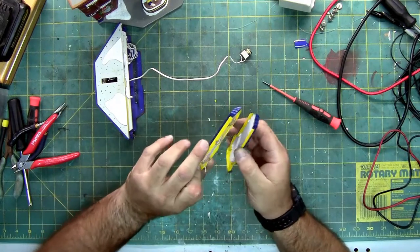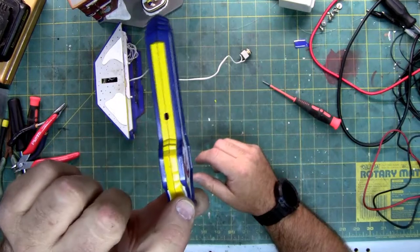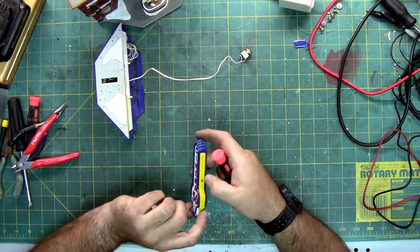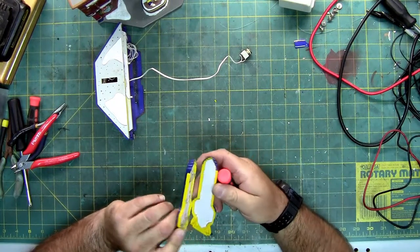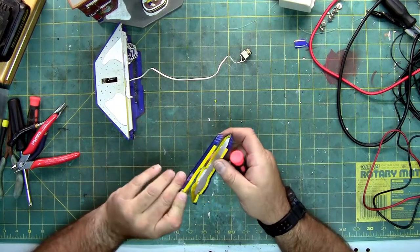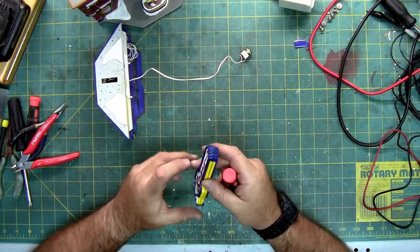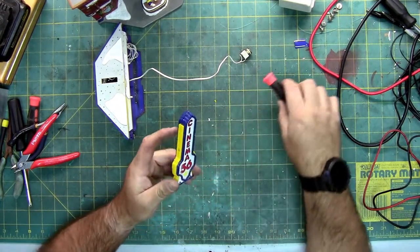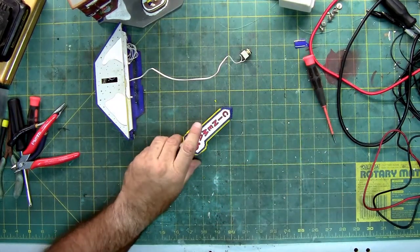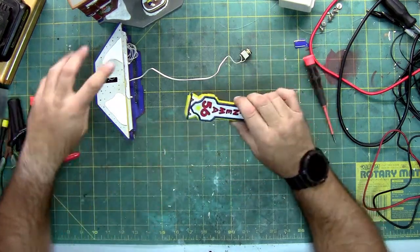Since there's this little notch, I'll put the 2 pieces back together. You see there's a little notch hole right there. I just use a small flathead screwdriver, pried it. Once it's split, I just use my fingernail to go all the way around. Because the glue they used is old and brittle. Old and brittle glue doesn't require a lot of heat because it'll just start cracking. Because this, being plastic, if you apply too much heat, you can distort the sign or yellow the white, which we don't want to damage it. I know it's already broken, but we want to keep it as good as possible.